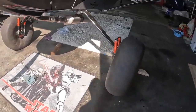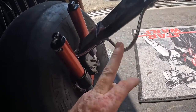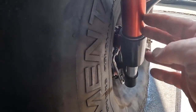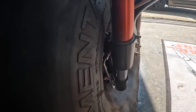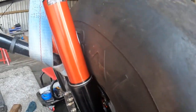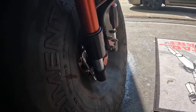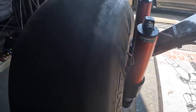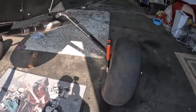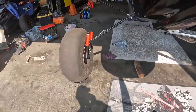All right, so we've got them installed — brakes are bled. I did have to pull the brake line out a little bit right here, so if this were a permanent install I'd shorten up the brake line and put a new fitting on there. There is really close clearance when this shock is fully extended between the tire and the black part of the shock mount. I've got contact with the tire — really too close. It gives you clearance on the red portion of the shock, but not the base. However, it only does that while you're airborne, so as soon as you touch down it squats down and gives you clearance. And this is a 29-inch, so this is the biggest tire you'd have on there — clearance without a spacer. We'll go fly it and see if we get any rubbing at all.